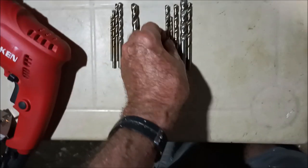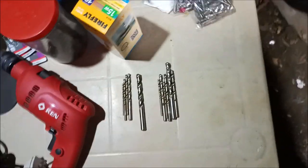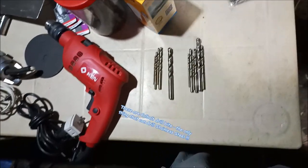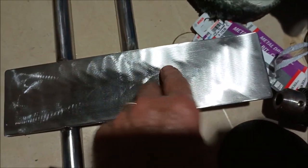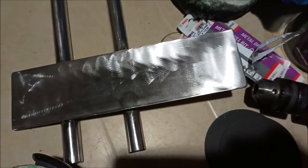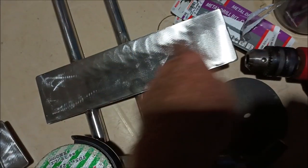These are just extra bits in case one goes dull — and they go dull so fast. You just have to go slow. Keep the bit cool — that's the secret. The second that cobalt bit gets hot it goes dull and then you ain't going nowhere. My brother-in-law suggested that since the 40 grit sanding feels pretty smooth even though it looks gouged, I should take my cutter blade and just score it — make some score marks back and forth — to give the epoxy something to grip to.